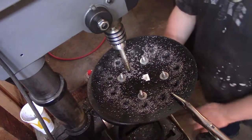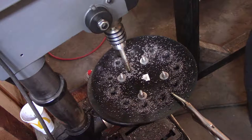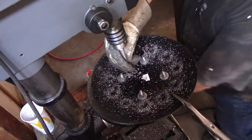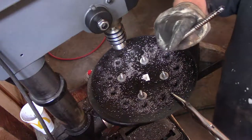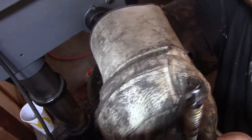That's awesome — I am very impressed. I'm going to get a glove because I know it's going to be hot. Let's take a look at that tip. It felt like it was cutting about the same the whole time — I wasn't noticing a major drop in any cutting performance. An old fella told me about that and I thought, well I've got hard metal now, let's give it a try. And it worked — those holes are fine, I'm happy with them, especially for what this is going to be. Figure if it can handle concrete, a little heat like this probably isn't a big deal.